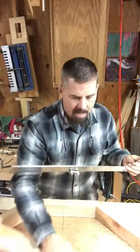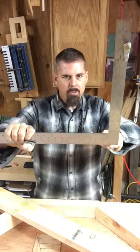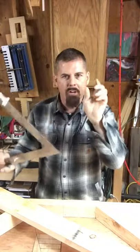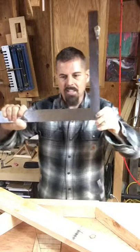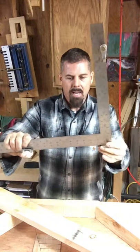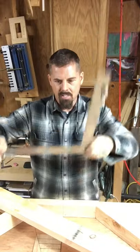Let's start right away. The parts of this square are: this is the body of the square, and this is the tongue. All the marks I make on the rafter along the body of this square — when I cut the rafter and stand it in place, you can put a level on them and they'll be dead level. Same with the tongue of the square — put a level on it and it'll be dead plumb. You have to imagine that although I'm marking on the bench, the body always stays level, and I like the heel of the square to be towards my abdomen, so I'm looking at a level line — that is intuitive to me.